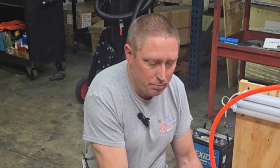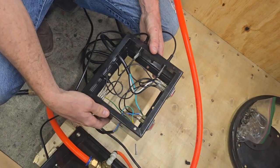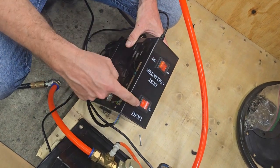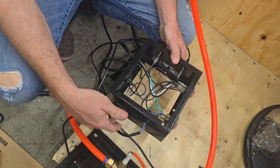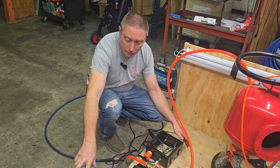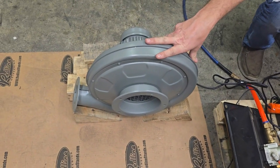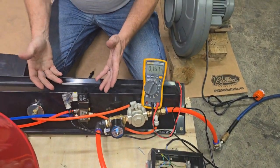Now let's talk about the electrical system on the REPP-70. This is our main electrical panel. Rather than showing you every single wire, we're going to post a picture of all the wiring as an additional photo on the REPP-70 product page, with a link in the description below. All components — the lighted switches, the fuse holder, and the electrical outlet that operates the fan for the vacuum system — are available on our website, along with photos showing how it should all be wired. Here's a demonstration of the blower motor that operates the vacuum. It plugs into the side of the cabinet, you have a switch for the dust collector, turn that on and it operates the blower.